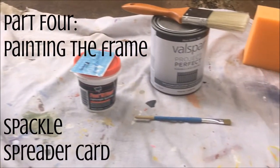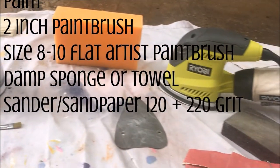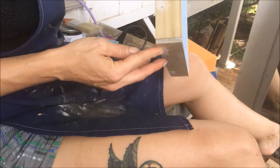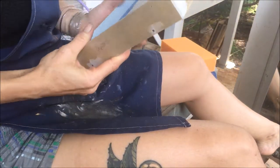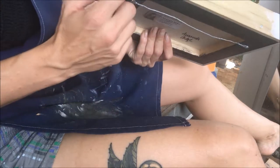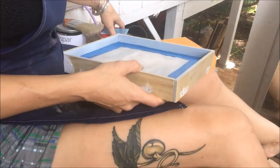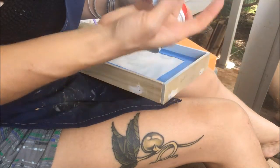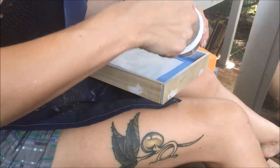Now we are polishing off and painting the frame. You can check the links below — I'll have a nice list on my blog. Now that the basic frame is built and the glue is dry, we're going to clean up our corners and make it nice and smooth, ready for paint. I've already spackled a few of these as well as the tiny little nails that are sticking out. You're going to want a regular package of spackle — if you have special kind for wood that's good, but just a little bit of regular drywall spackle will work as well.